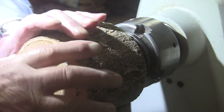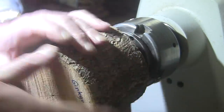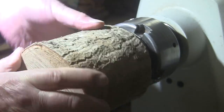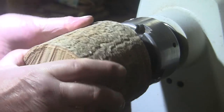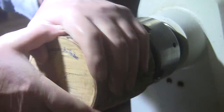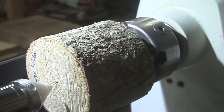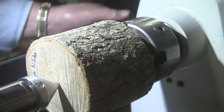I did a little research on this wood before I came out here. It's a very ancient wood — it has survived a lot of Earth's history. It's a tight-grained wood, even though it's kind of soft apparently. The piece doesn't weigh a lot, but I can see it's making some nice shavings, so tight-grained it is. I have an idea of how I want to do this, but I haven't planned out the steps exactly, so we'll kind of figure it out as we go along. We'll use tailstock support just while we round it up — shouldn't need it for much longer than that. My center hole is off slightly. That's okay. About 1300 RPM.